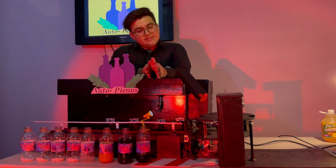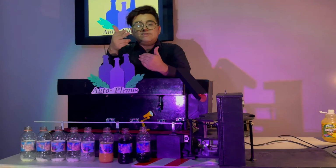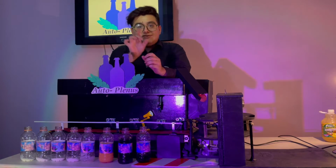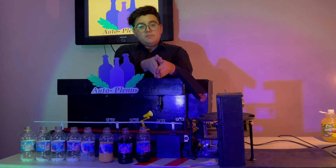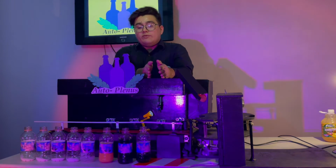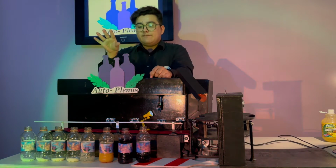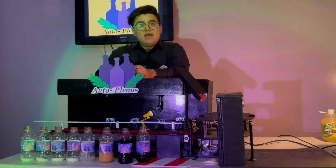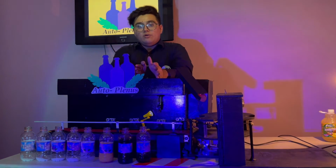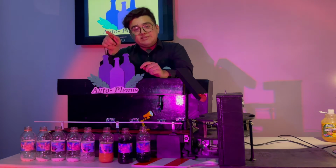When the sensor starts sensing, it's going to provide us the measurements of the distance of the object. When it has already sensed it, it's going to show that the bottle is in front of the ULT-P, which is the ultrasonic sensor that is going to control the line. It's going to stop this one, and after that, it's going to provide us the centimeters from these other two. And then it's going to stop all the line, and the next stage is going to begin, and it's also going to be presented right here.